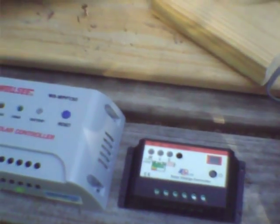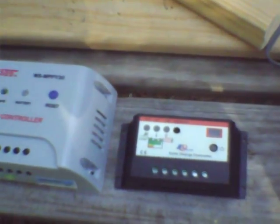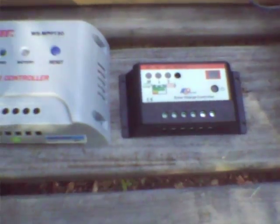If you're like me — even though I've got about 640 watts of photovoltaic modules — that's only the case with my five Harbor Freight kits and my three QS Solar 60-watt modules. Everything else, which is about 200-plus watts of modules, they're all different, even though they're all 12-volt nominal modules. That's where pulse-width modulation controllers come in.